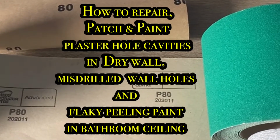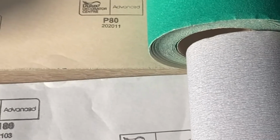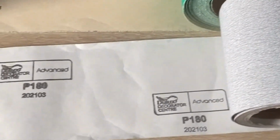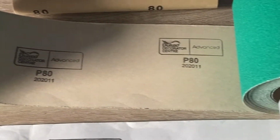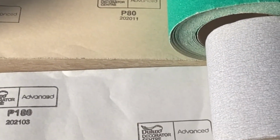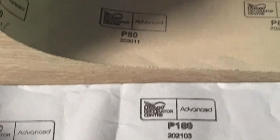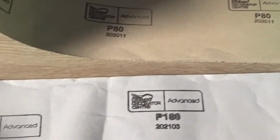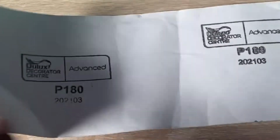This video shows you how to patch your drywall. Prior to patching any wall, preparing the surface is really important. This entails making sure that the surface to be repaired is clean and smooth, and trimming away any frayed drywall edges from the hole. I've used an 80 grit sandpaper for heavy sanding, to help remove scratches and imperfections on the wall.